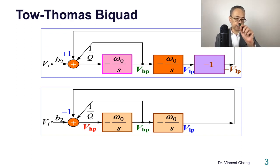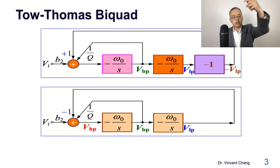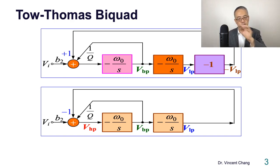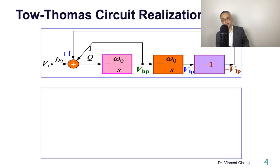Because going through the negative one, the output of the inverter is going to be negative VLP. So we have HP, BP, and LP. But in the version on the top, since we're going to use one operational amplifier to put the adder and the first integrator together — to merge the adder and the integrator — the high pass function is no longer available. So the top version only offers two types of filter function: band pass and low pass.